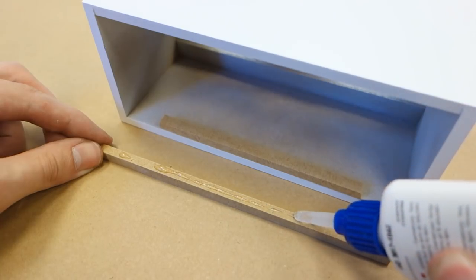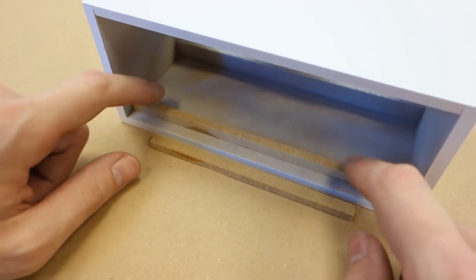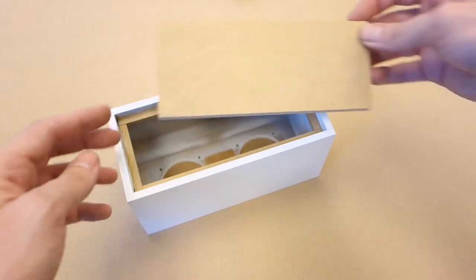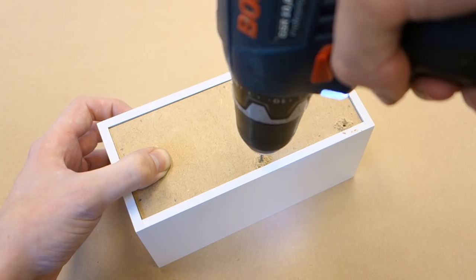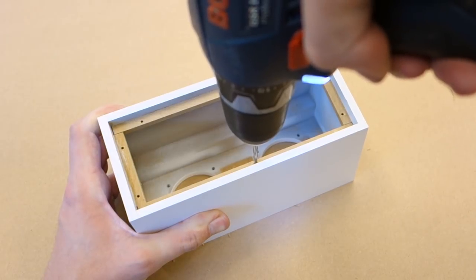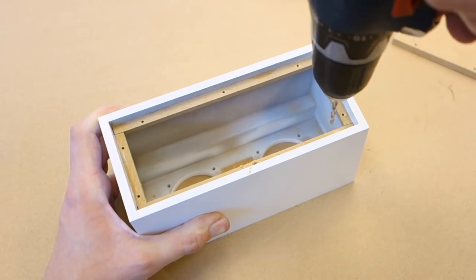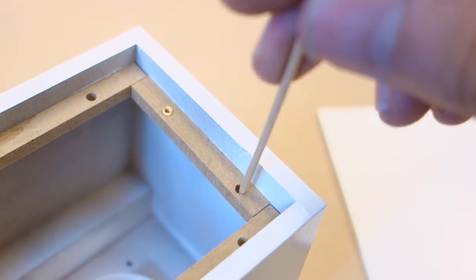The backside was simply put in with some thin pieces of MDF, into which I could fit threaded inserts. I couldn't really glue in the backside, as I may need access into the speaker in the future. I could of course have made this speaker bigger to allow for a better way to put the back in, but I was really trying to keep the size small, so everything is a bit cramped and the back a bit finicky to put in.